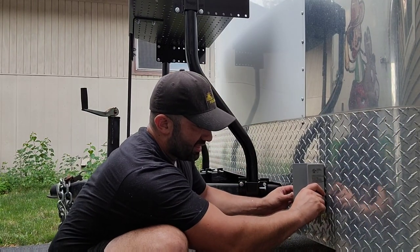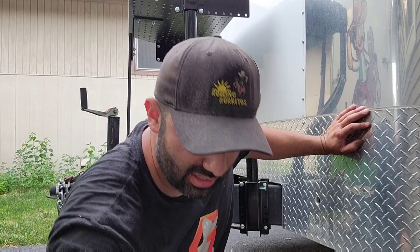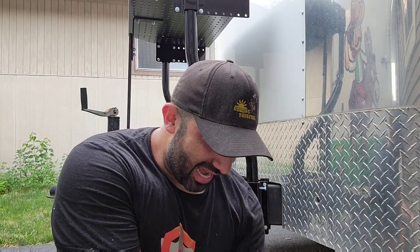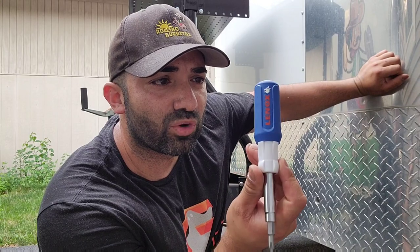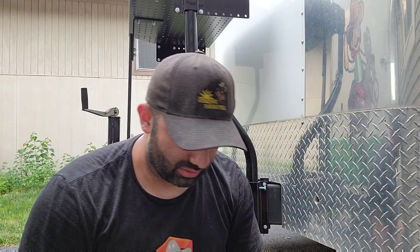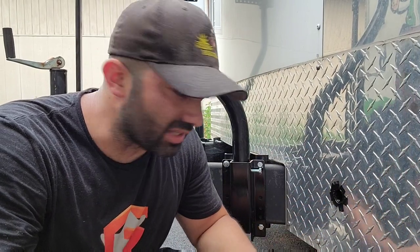So that's how we're going to run this SO cable, and then I'm going to put the box right there and secure it with stainless steel screws — I'll link those in the description. I'll be skinning this wire back with my Milwaukee utility knife. The tools I'm using are: the Reliance generator inlet box, my utility knife, wire strippers, a Lennox nine-in-one screwdriver, my impact driver, and a unibit step bit. I put black electrical tape around the sharp hole edges and smoothed it out with the step bit.